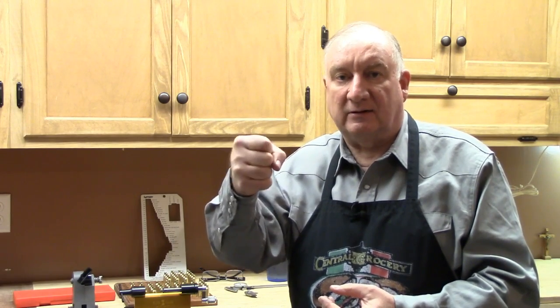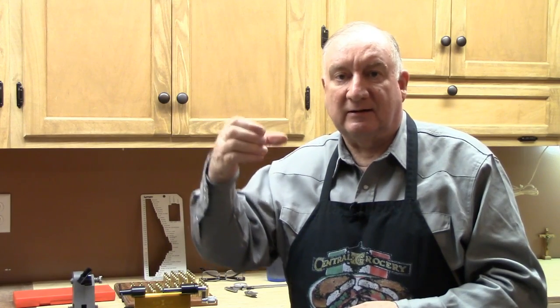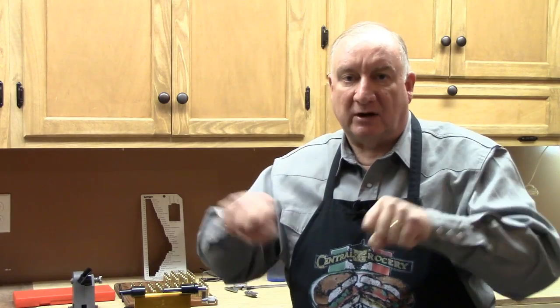That's a system which involves a collet inside. If you've ever seen how handlebars are attached to a bicycle, there's a collet in there that grabs the handlebars. It's exactly the same sort of thing. It's based on the same principle, where as you drive the die up against the top of its stroke, the collet squeezes in. It's got four fingers, and they squeeze in on the case and enclose around the case down onto that mandrel. I prefer that over the ones that slide down because it gives you less manipulation of the brass. In other words, you're not milking that brass down as if you're milking a cow. You're not drawing the brass down, which changes its length and rolls it out like pie dough. It's basically just closing around the case and reforming it tightly around the mandrel.